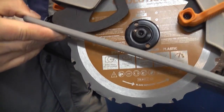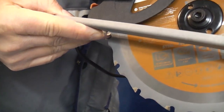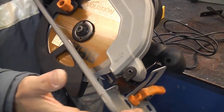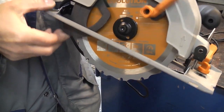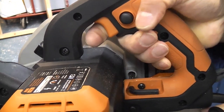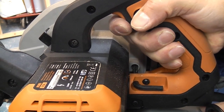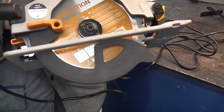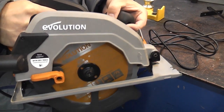This has a maximum depth of cut of 64 millimetres. If you put it on a 45 degree angle that is reduced down to 43 millimetres. The beauty of these saws is that you can cut mild steel up to 3 millimetres thick using the same blade. It also has a safety trigger so you can't accidentally squeeze the trigger — you need to press that part in first with your thumb before you can press the trigger. One really good advantage is that it does have an electronic brake, so as soon as you pull your finger off the trigger it actually stops within a couple of seconds.